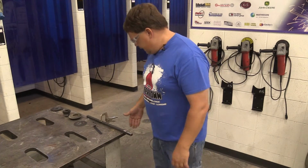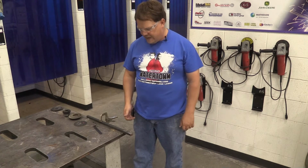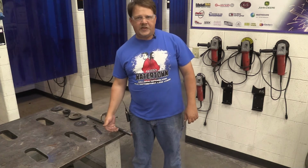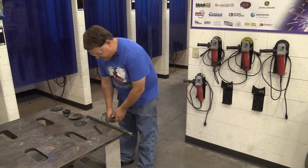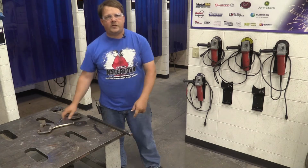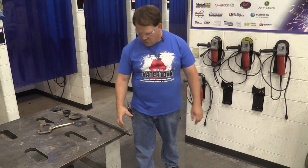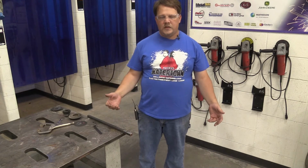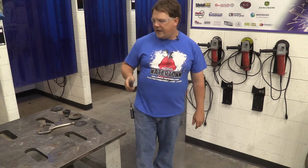Also beware, this part's definitely going to be warm right now because I just did a whole lot of grinding on that. And if you're grinding near the table, it might even be warm. So just be conscious of some of those things that are going on that other people might not know. If you walked away from this hot piece of metal, somebody else might walk up, not know anything, and grab it and hurt themselves. So always be cognizant of your own mess in your own area as you're moving things around.